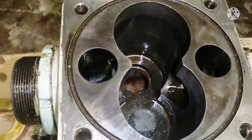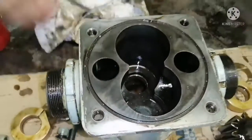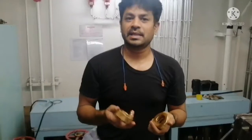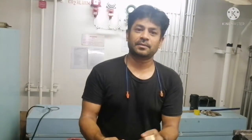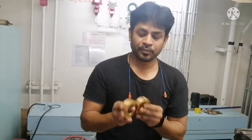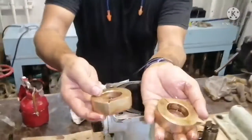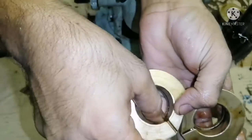So now I can box up this gear pump. This is your bush. Basically this gear pump doesn't have a bearing like other pumps that have ball bearing or roller bearing. In this case this bush acts as a bearing. This bush has a slot — you can see a slot over here which goes through to the inner side of the bush.